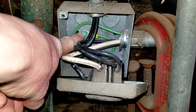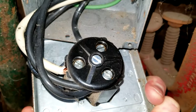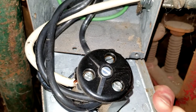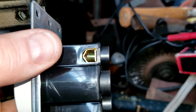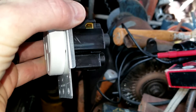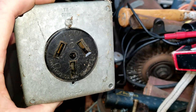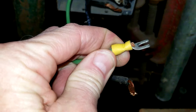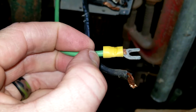I'm going to go ahead and loosen this one up and take that little bracket off to be able to insert it in my new receptacle. On the back of the old receptacle you're going to see those flathead screws — go ahead and loosen those screws and pull out the wire. The gauge holes look like they're the same, so you would be able to reuse them since this particular one accepts gauge four, six, and eight. I'm going to go ahead and cut this wire since it's crimped on there pretty tight. I'll strip it off and insert the green into the green terminal of the back of the new receptacle.